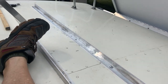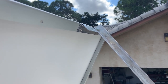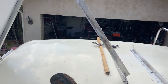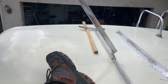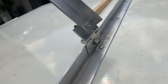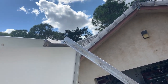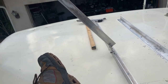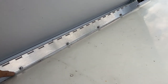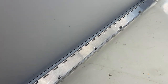Hello, it's Saturday, February 12th. Back on the solar again. The last thing I did yesterday evening was make up these angle braces. I don't know if I'm going to need these for real or just for doing maintenance — I guess it is for real. I just took leftover pieces of hinge and cut them in roughly three-inch lengths. Now I've got a secure means of holding this up. I don't have to worry that if there's a wind gust it'll blow this thing over. I've been using sticks and been very uneasy about the idea, because if one of these panels blows over to the other side, it'll be catastrophic — probably destroy the panel and potentially rip this angle rail that I have bonded onto the bus.